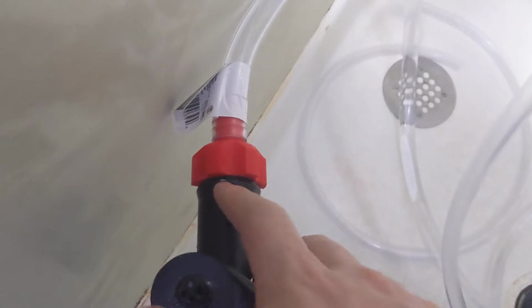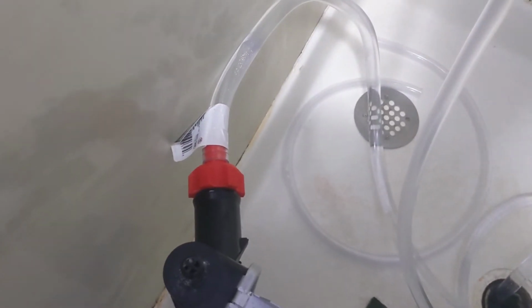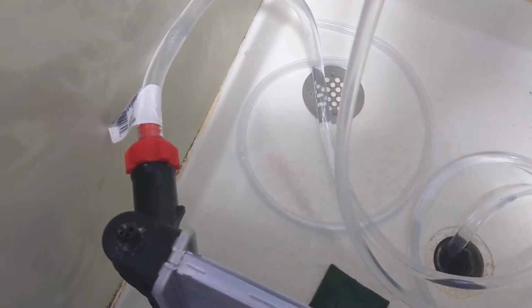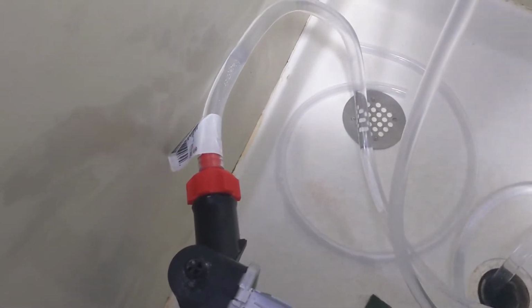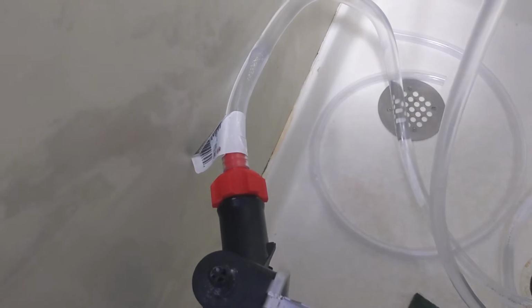But I didn't want to try to measure this with a 3D printer and print that accurately. So I noticed the inner diameter was exactly 30 millimeters, and I went ahead and just printed that. In the future, if I did this again, I would make the outer diameter slightly larger, like maybe 30.1 or even 30.5 millimeters, so I get some friction pressure.